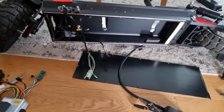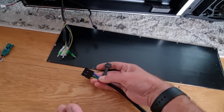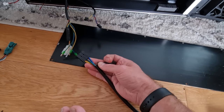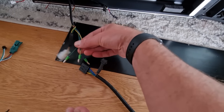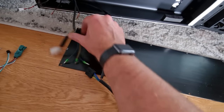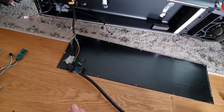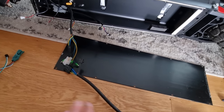So all we're really worried about is motor and throttle. In order to do that we're going to have to do a bit of soldering, because that connector is not going to fit those three phase wires, and this six-wire hall sensor connector doesn't fit that either, so I'm going to have to splice those two together.